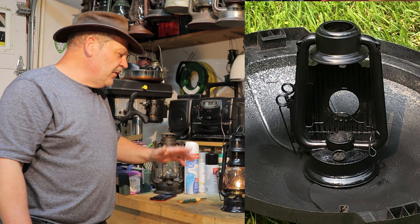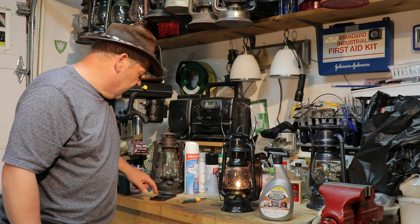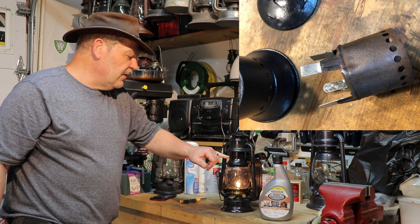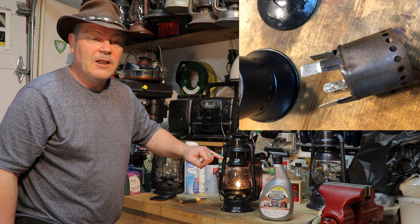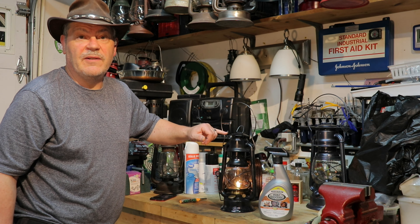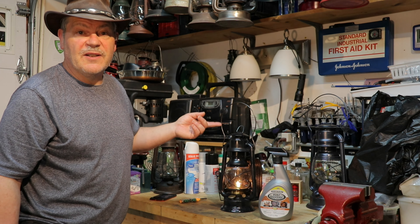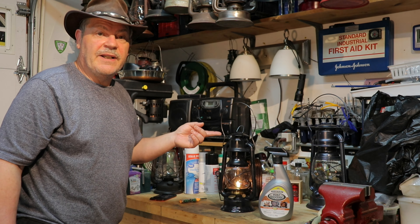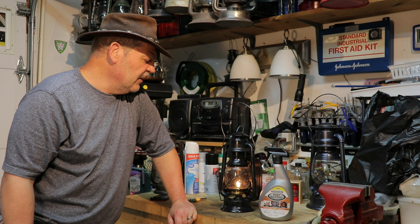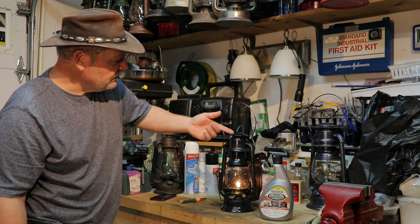That was before I still had the crown and chimney assembly to deal with — that was another fiasco. The inner chimney assembly had all the tabs broken off, so I had to re-tab that, as well as the outer chimney assembly. The crown was actually missing too. I happened to have parts from an old Dietz Junior that was all roached out — I had saved the bail, the crown, and the globe — so I was able to adapt that crown for this lantern.